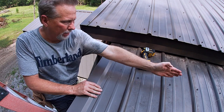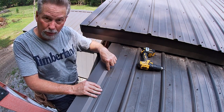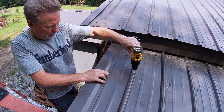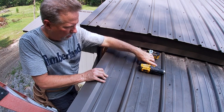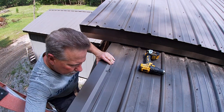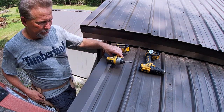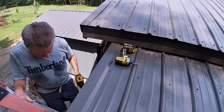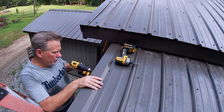I want to keep the uniformity. Right here is a row of my screws that lock down the regular sheeting on top. I know there's a 2x4 right underneath here and I want to screw into that solid meat. So I'm going to follow this line over — I'm on this flat part on top and this is where I'm going to drill through. Then following the same trend, I'm going to come just above where that metal kicks out — where I told you the water would go off — and I've got a 2x6 roof truss over here, which is good wood to go into. So I'm going to follow that straight line and drill through both of these metals.